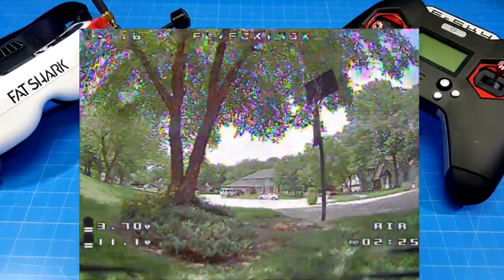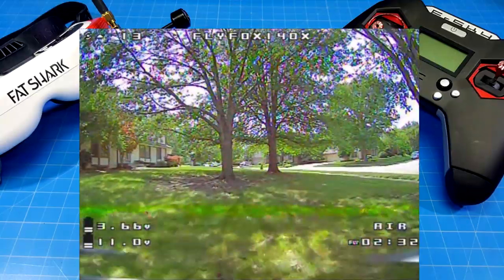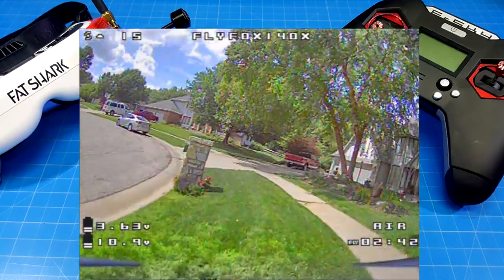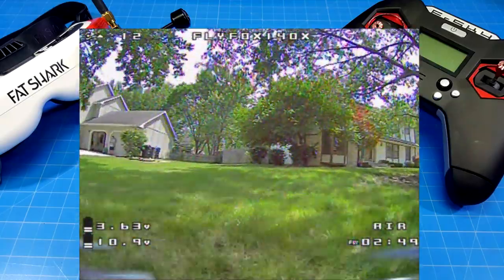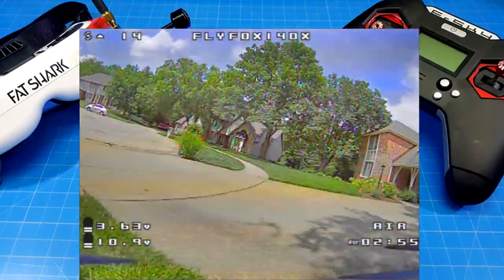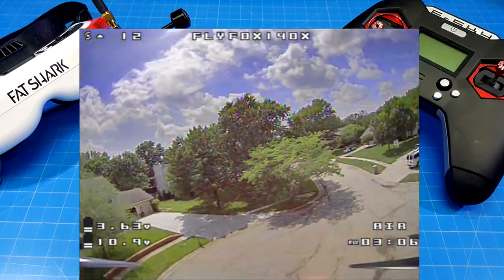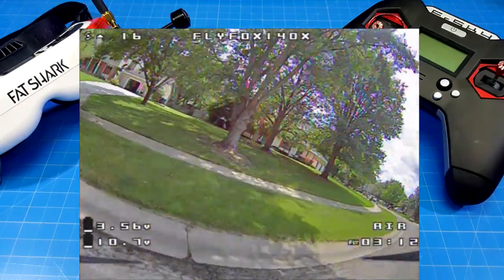This VTX isn't especially good, and I should mention this is not a one-to-one representation — this is the goggle DVR with my HDO goggles from Fat Shark and my Rapidfire module running firmware 1.17 and Axii antennas. I run two Axii antennas. It's kind of funny — I got pushback about running two antennas that way, but about four months later that's actually what Immersion RC was suggesting unless you're doing long-range flight where you need a patch antenna, and I started using them because they came in the kit my wife purchased for me from GetFPV.